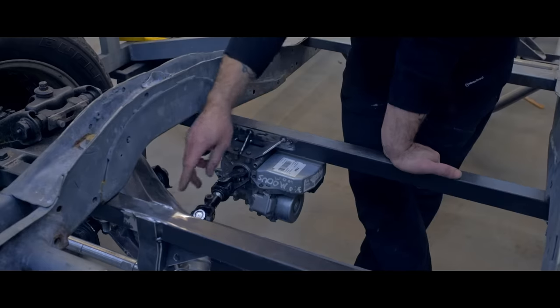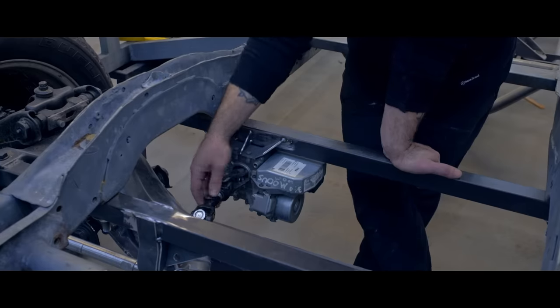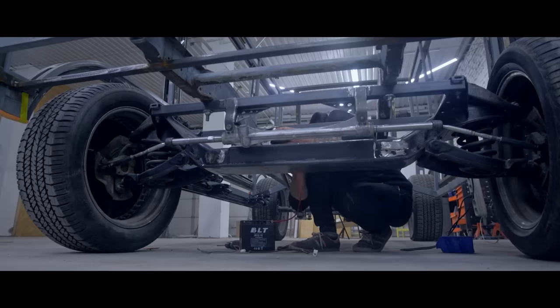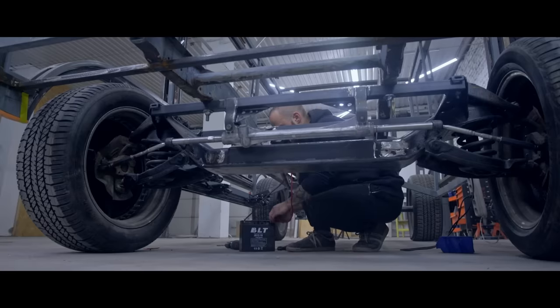We connected the joints from the RAV4 and Clio 3 steering racks. We connected it just to check. We're gonna weld and reinforce them later. As I said before, the connection of this power assist is quite ordinary. We plug in the plus and the minus to the battery, and the control plus from the ignition switch. That's it. Let's put it on the plus.